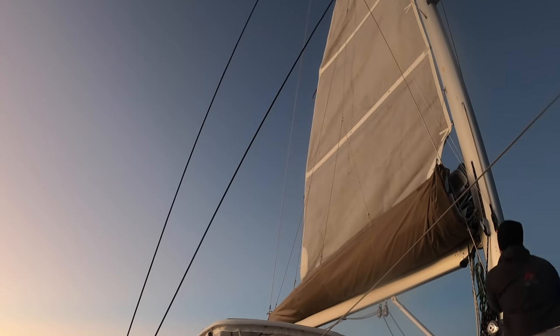The Dacron sail, on the other side, has a couple things going for it as well. First of all, it's a lot less expensive. A crosscut Dacron sail is going to cost somewhere between a half and a third of what a laminate sail would cost. Secondly, with Dacron, if you keep it covered from the UV rays, the fabric itself may actually last longer, even if it's all stretched out.